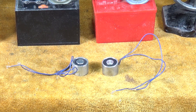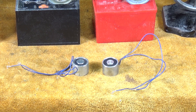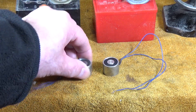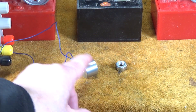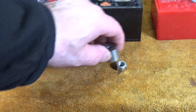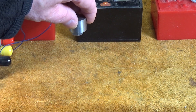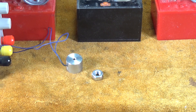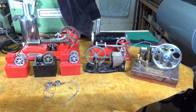Here are a couple of small electromagnets, very similar to the two large versions on my electromagnet engine. They have a fixed core — it's a coil of wire inside a metal tube wrapped around a fixed metal core. I've got the electromagnet connected up to the power supply. We'll turn the power supply on and it should attract the nut — there we go, no problem at all. Now I'll turn the power supply off, and there we go. That's basically how electromagnets work — as simple as that.